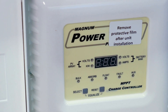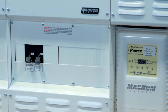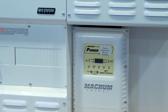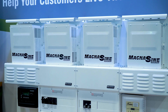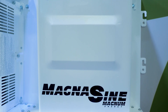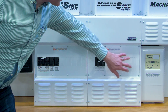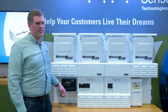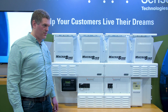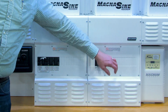The panels themselves support integrated AC breakers — both DIN rail and back-mount type breakers — as well as DC breakers. You can see there's a lot of space with knockouts on both panels. We have large knockouts for the DC disconnect breakers for the inverters, and small knockouts that can provide circuit protection for other DC accessories, or when used with a PT100, can bring in at least a couple of PT100s on the DC side of the panel.